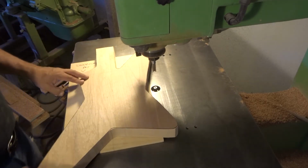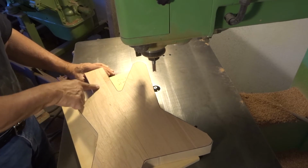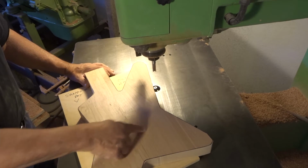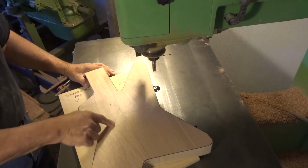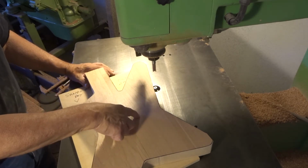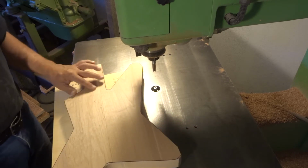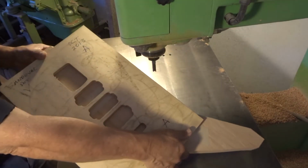What we're going to end up with is, on the neck pocket right here, it'll be 5/8 deep. We've got a humbucker here, which will be 5/8, and then we have our tremolo route, which would go all the way through. The humbucker also has the places for the humbucker tabs that go into the body. I usually route those about 1 1/8 inches deep, but the pattern that you see coming out here will be the pattern that's on my template.